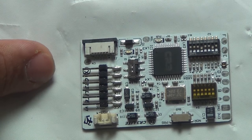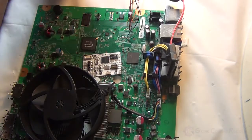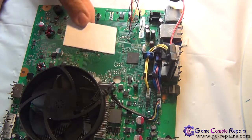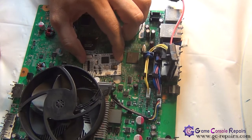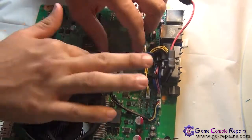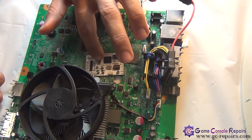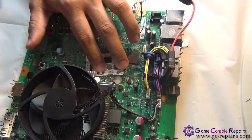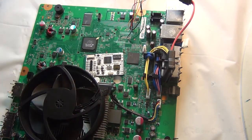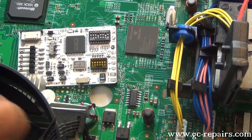Let's install CoolRunner onto our board. We'll be soldering CoolRunner CR3Lite onto our motherboard. Simply place your adhesive pad and place it here. Make sure the switches are on program and this switch is on to the slim side. Next, let's pre-tin our CoolRunner connections — grab your flux and we'll pre-tin the CoolRunner connections.